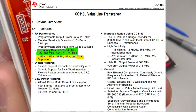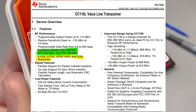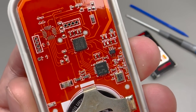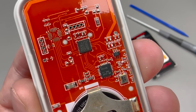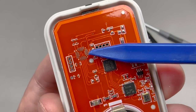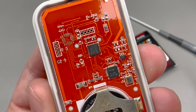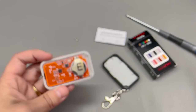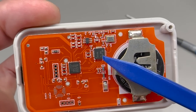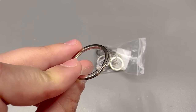This is based on a chip from Texas Instruments — the CC1101 — which I'll link a datasheet for on screen. It's capable of all those frequencies and different modulation techniques, and it's controlled by a Chinese-supplied microcontroller. Interestingly, they even have two footprints on the board — they have this microcontroller here but also a footprint provisioned for an alternative, probably in case they can't source the original part. The hardware is really capable on this remote; I'm not sure how capable the firmware is, but just considering the RF chip, it's capable of all those frequencies depending on how you program it.